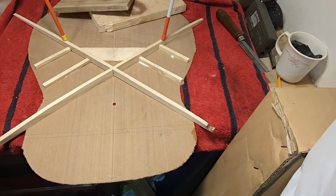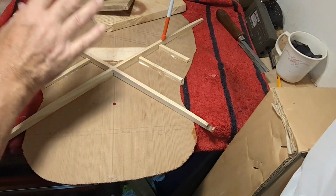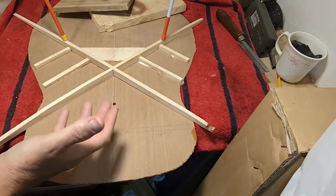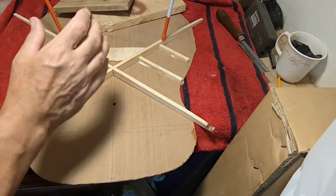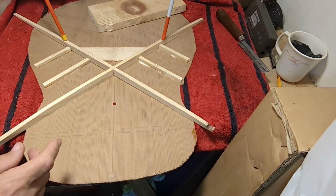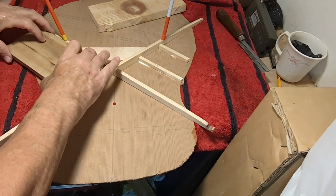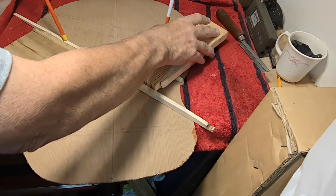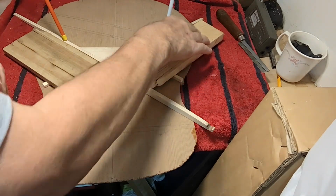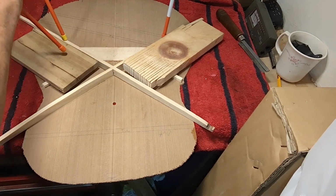And what I'm gonna do, I really want a Go Bar deck to do this with, but I really need like a 28-foot radius dish. I really don't need one for the back because the back has only got four braces on it, basically. But I could use a 28-foot radius dish for the top. It would make stuff like this simpler. But I have basically a block of wood that is going to create a wide caul and spread out the pressure of the clamps or of the Go Bars. Hopefully that's what will happen.